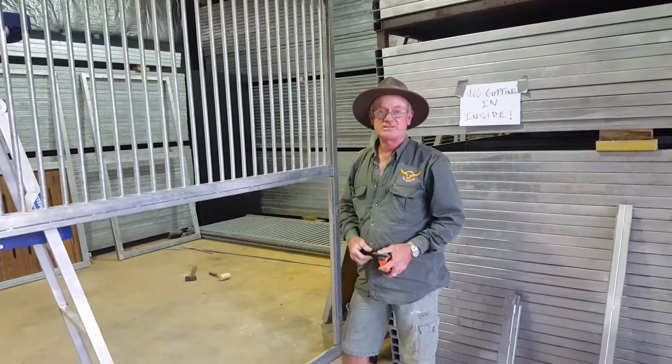Okay, that's the sliding door. I've showed you how we need to put the inserts in, the bamboo, the ply on the divider. It's the same thing with the fronts. When you put the ply on the fronts here, you still have to have a joiner, because unless they're a 3600 panel, then you don't need a joiner with the big door. But if you're using 4 meter bays, then you'll end up having to have a joiner.